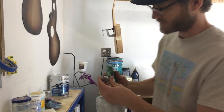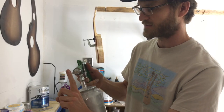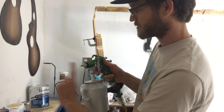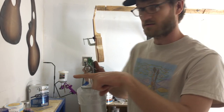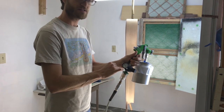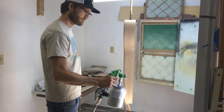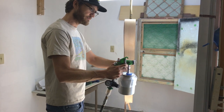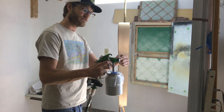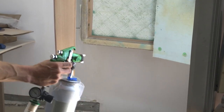One other thing, when I'm putting the nozzle on here, I'll be moving the spray pattern. When it's like that, the spray comes out horizontal or vertical. When I have this vertical, the spray pattern comes out horizontally. We're at about 40 pounds of pressure on my air. That sounded good. You hear that sound? That's the sound of the material going up through the siphon, coming out the nozzle. Now it's full of material, we're ready to spray. That's a good even spray on there.